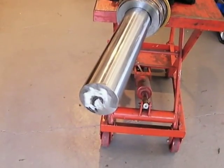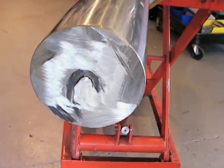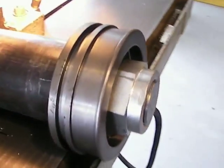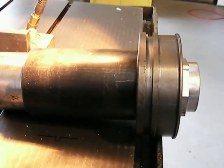On the cut-off saw, after about an hour and a half, we were able to cut the 3-inch cylinder off. Here's the stub that we're going to turn down and add the other cylinder half to, to make it a rodless cylinder.